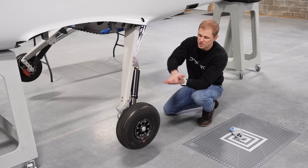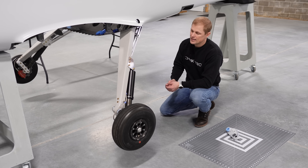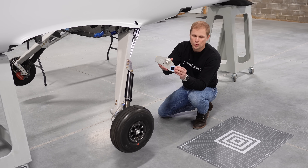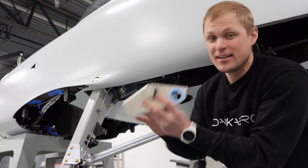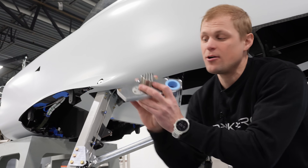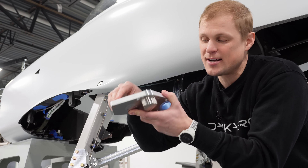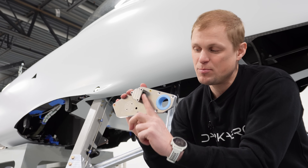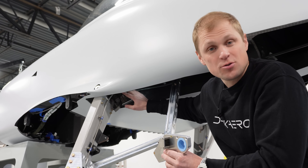So we've seen the basic structure used for landing and taxiing, the retract operation, and the lock down and lock up functionality. Now we need to actually drive this through the retract motion, and that's where our gearboxes come into play. This gearbox is going to drive our landing gear struts up and down. This is the right side unit; the left side gearbox is already installed — you can see it tucked away up in the wheel well. Within this gearbox there's a big gear reduction drive. A motor attaches on the back side and drives the gears within, transforming the high-speed motor output into a much lower speed at the pinion output gear but with much higher torque. This pinion gear interfaces with a large gear attached to our gear strut, and that's what drives it up and down.